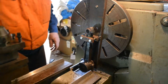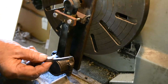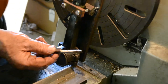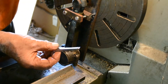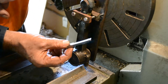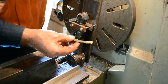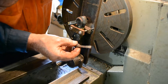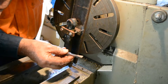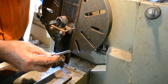The tool I'm using is just a high speed steel tool bit that you can get online or buy at garage sales. If you're buying a lathe you might get some with it. It's pretty cheap, probably ten dollars for that bit. Very good quality - P&N, Australian P&N Sutton P&N, very good stuff. I've just ground it down and made a little boring bar out of it. I find that's the best type of boring bar for this work. I do all my little bushes and things with the same boring bar.